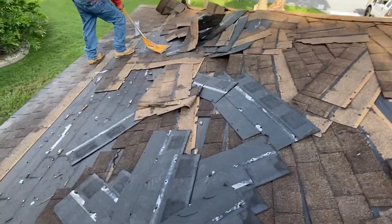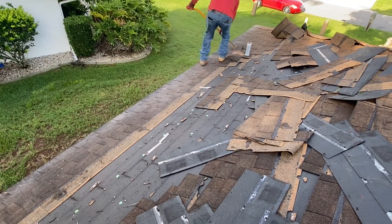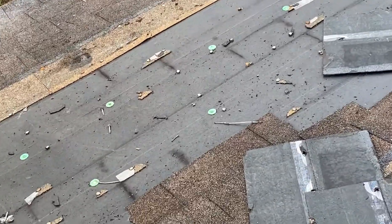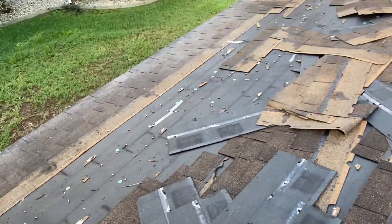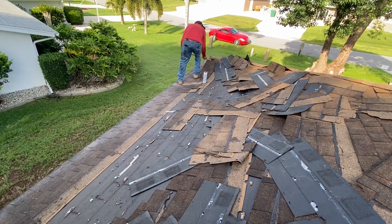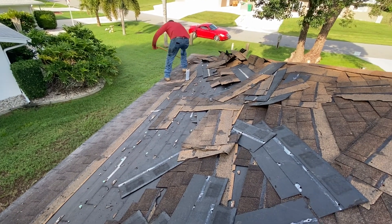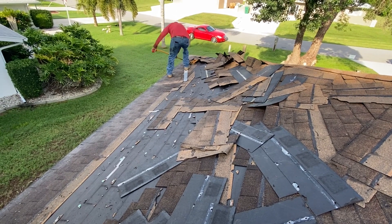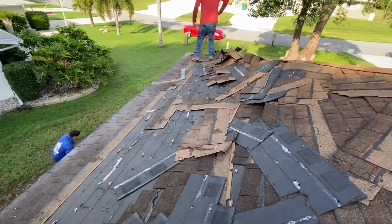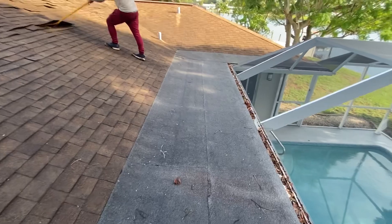As Juan is taking off the first layer, there's actually another layer underneath. That is the waterproof barrier. Back 20 years ago when they put these roofs on, they were using tar paper. We have something much better today. On the tar paper, they would use these green roofing nails to hold the paper in place. So the next layer that has to come off is the underlayment. First comes the shingles, then the underlayment, to get you down to the bare wood. A lot of times you may find two layers of shingles — sometimes it's a surprise. This one only has a single layer. They call putting a second layer an overlay, which makes it a lot harder with a lot more material to move. This house also has a flat roof section — same process for removal.